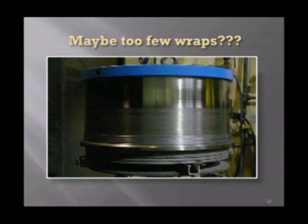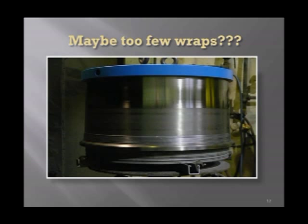Slip causes wear, slip causes grooves, slip causes marking. So if you walk through your wire mill and you see very few wraps like this on your blocks, there's probably a lot of improvement that can be made on your machine, to include the speed, quality, and the life of your blocks.